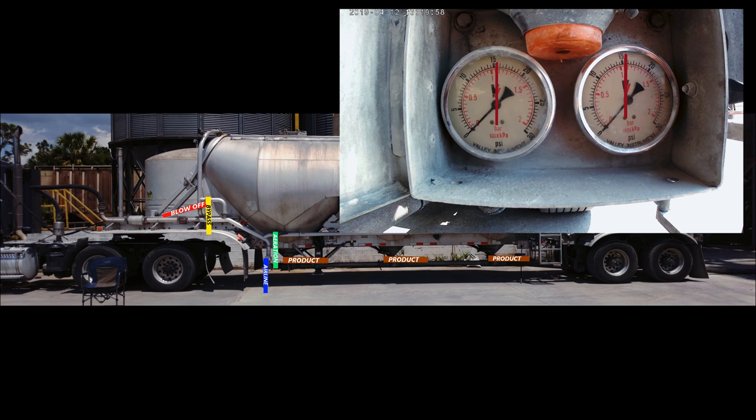There are two ways to go about opening blow off. I usually just open it, but you can also turn the blower off and then slowly open the blow off valve if you don't want to make a big dust cloud. Once the tank pressure gauge drops to 0 psi, the dust cloud will clear up. If you decided to turn off the blower, go ahead and turn it back on. Your line gauge will be at 15 psi.